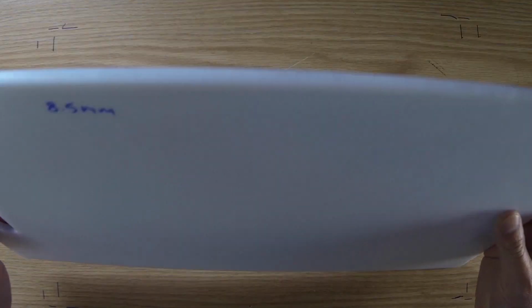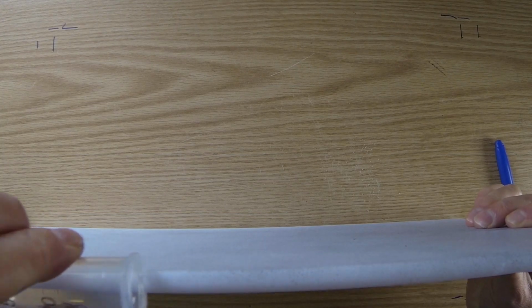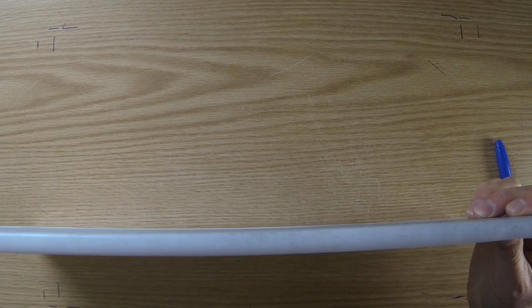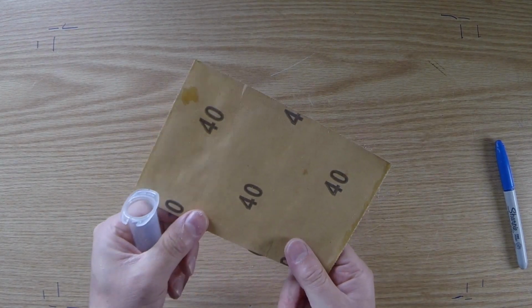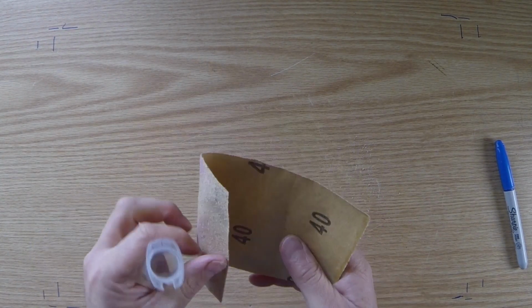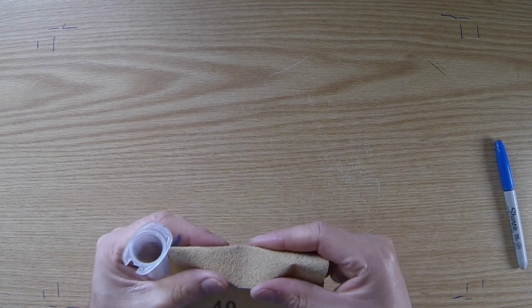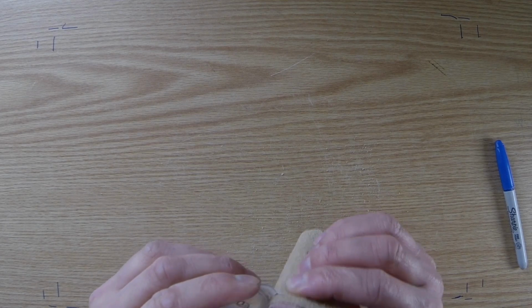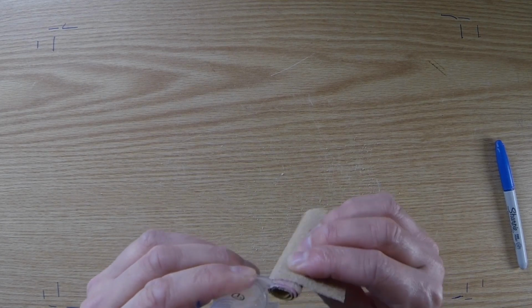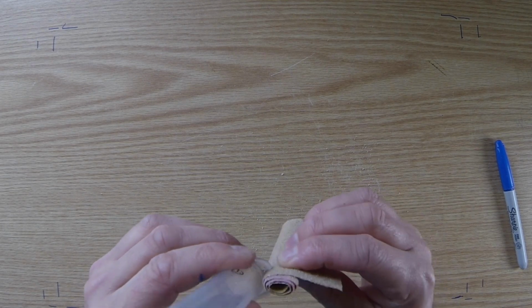When you think you have finished making the slot, check it with a ruler, or even better, try sliding it over the edge of your cutting board. There is a little too much friction between the 2 surfaces for my liking, so I'm going to roll up some rough sandpaper into a tube and squash it between my fingers so it conforms to the shape of the slot. That way it will remove material from all 3 sides of the slot as I sand.